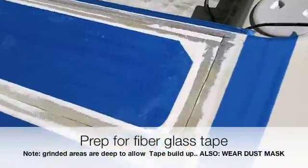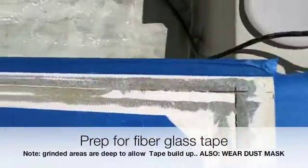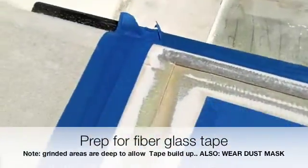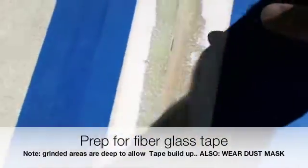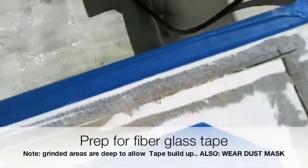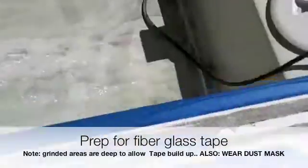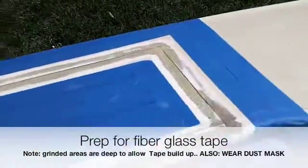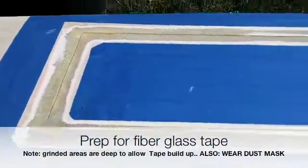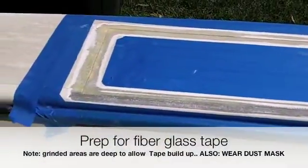It's a pretty sunny day out, got my dust mask on — it sounds a little fuzzy. I've ground out the gel coat all the way around this so I can tape it. As you can see, I've carved down deep into the valley so I can get a good purchase of the new fiberglass tape. Typically I like to go wider, but I'm not going to go heavy, and you can see it's on both sides. Using slow epoxy today because this stuff's going to be hot and it's going to be cooking up quick.